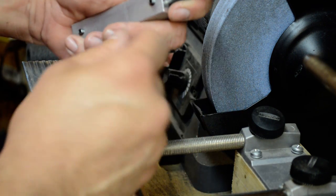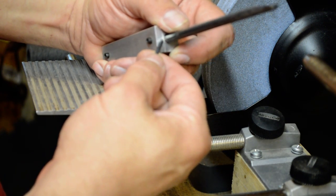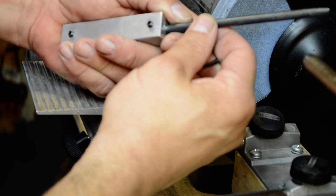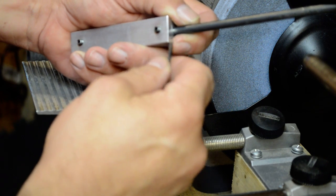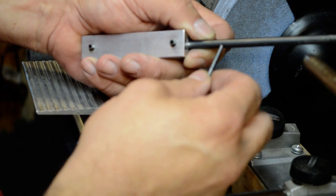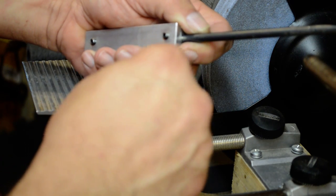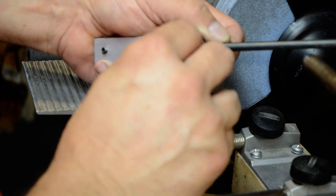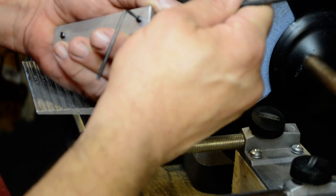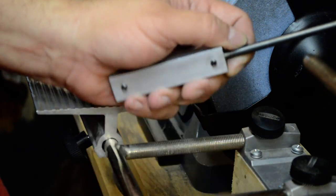What I've done is taken a center punch and made a little punch mark on the face of all of these jigs on all sides. Whenever I get my drill rod set in there and locked down, I'll take a needle file and run it across the top just enough to get through that black oxide. Those are your witness marks — you can go back and get the same position. Get it toward the top: one, two, three bumps and you're good.